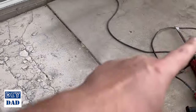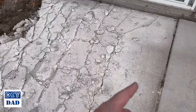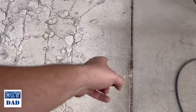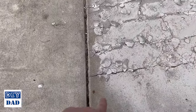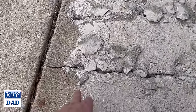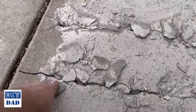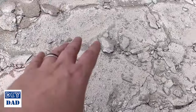What I figured out is you can actually guide the breaking if you're careful in the first step. Use your bit to do a couple of relief holes — essentially chisel in about a half inch or so in a few different spots. Then as you go deeper at one of the connections, your cracks are going to naturally run from spot to spot. Here was one relief, here was another, and as I started cutting in, the crack formed and went right across.